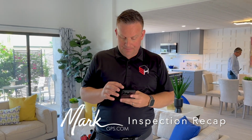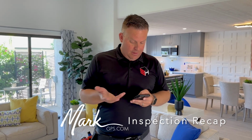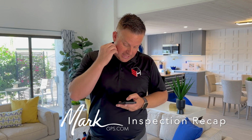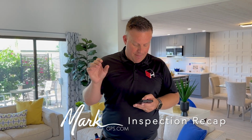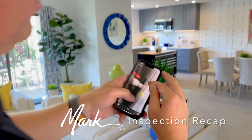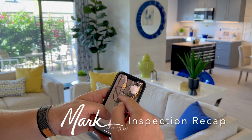But everything ran great on your furnace. We were getting about 101 degrees. It would have probably got up to 110, but I'd rather not have 110. Thank you for not doing that. So that's working fine. The only thing I do recommend is installing a rigid gas line. There's a flexible gas line that's running through the furnace case. Honestly, it's not a big deal, but I have to tell you, it should have a rigid gas pipe.